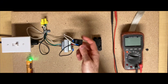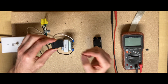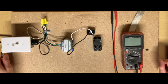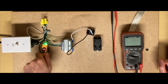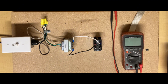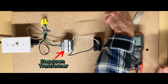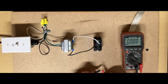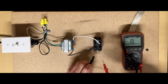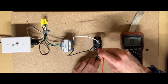For the demonstration I have the relay and the rectifier detached from the relay. That rectifier has a five-second delay, by the way. With the power off I'll attach the rectifier to the relay coil terminals. My meter is set to continuity or ohms, checking between terminals 6 and 8.